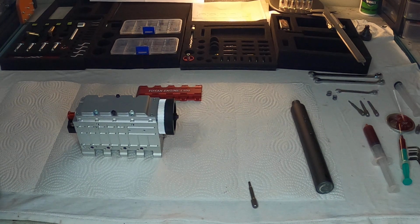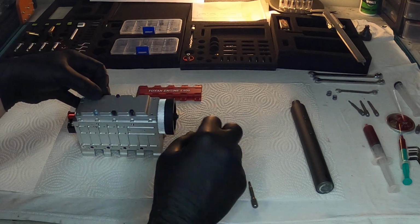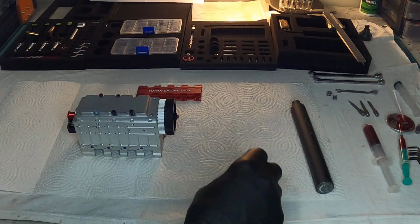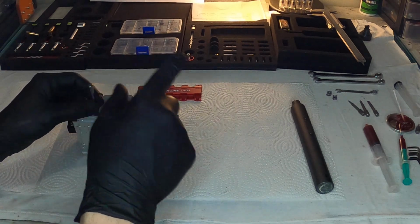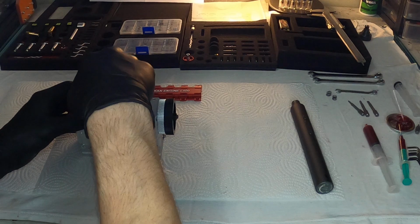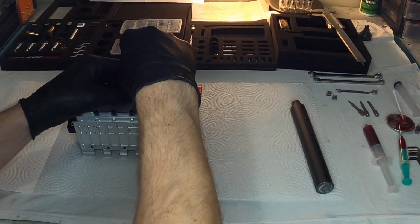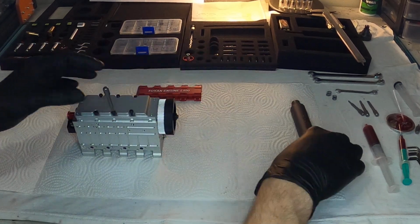The instructions tell me, you know, to put that oil hole facing the carburetor assembly, and that does kind of make sense because when you're revving up this engine and the rotation that the crankshaft is going, as oil is dripping down and whatever is not burnt is coming into the crank area there, that's going to get picked up on the crankshaft, and as you speed up with RPM, that's just going to take that oil and force it down the hole, which is pretty neat when you think about it. But it's going to use that centrifugal force of the crankshaft to force oil into that little hole, lubricating the connecting rod and keeping everything nice and lubricated.